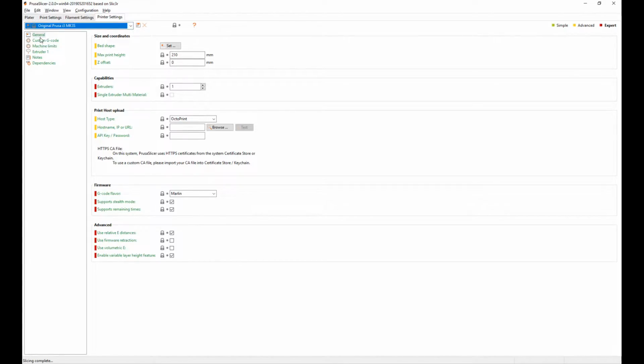So the first thing you do is to increase the number of extruders. Palette supports 4 materials, so we're gonna stick 4 in there. And then we're gonna enable single extruder multi-material. We apparently are not. Okay, I had to tab out of that before I could get any further. I enable this. And then I go disable variable layer height, because that's gonna mess up the purging. It will have issues synchronizing the purge tower if you leave this on. So I'm gonna turn it off.